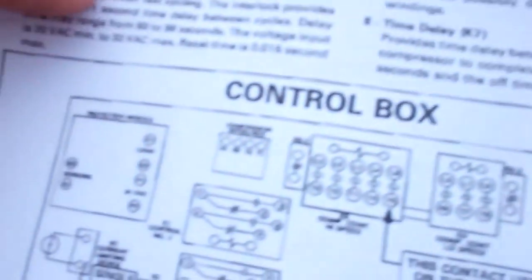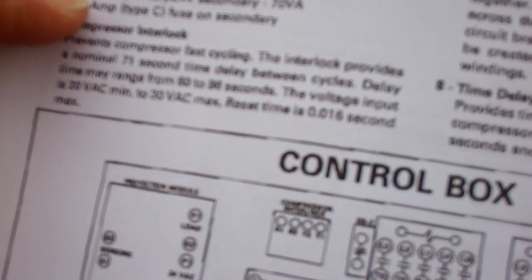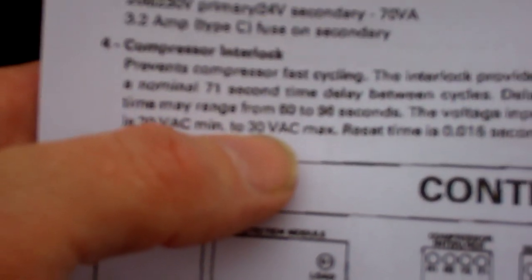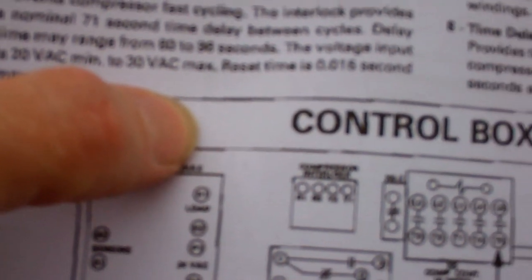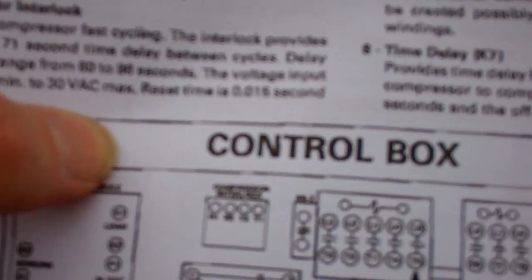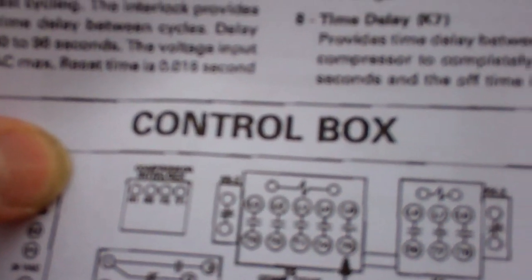It's been running for a bit — only took me an hour to work out that was buggered. I've got the instructions here, printed off last night, trying to find out what the compressor interlock does. Looks like it prevents fast cycling, so it's an anti-cycle timer — 71-second delay between cycles. So it's just to stop the compressor cutting in and out quickly if they're adjusting the stat on and off or something like that. Not sure why it's got four connections — that's probably just the design of it.